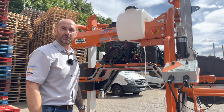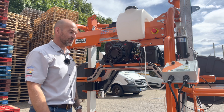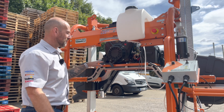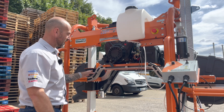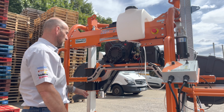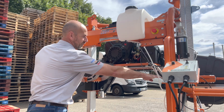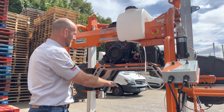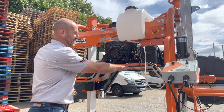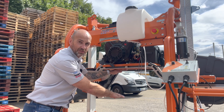When you look at the mill head on this mill, at first glance it looks a bit like an HD36V2. But for the HD38 to achieve the 14-inch cutting depth, what Norwood have done is they've stepped the engine up. On a normal HD36V2 the orange platform will be all in one piece. Here, they've broken it up into three pieces and used cast aluminium arms to actually lift the engine higher up. That therefore gives you your 14-inch cutting depth.